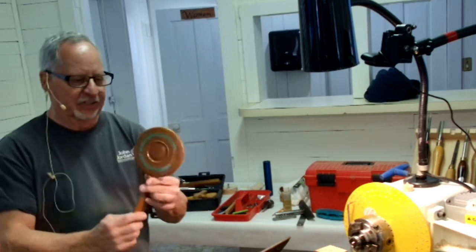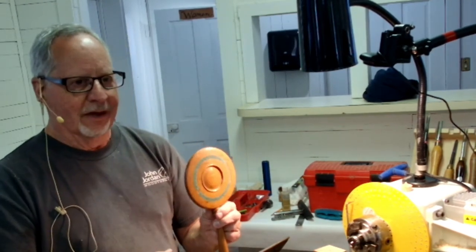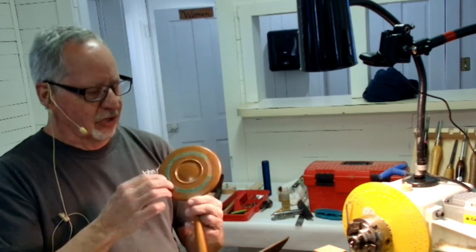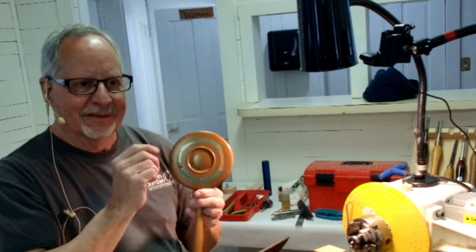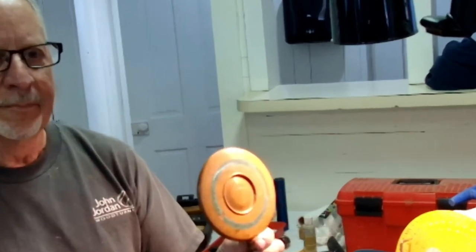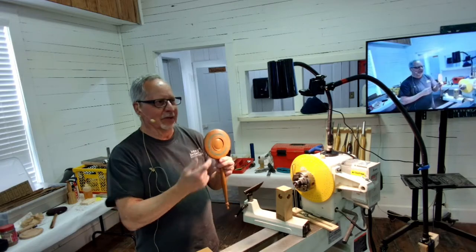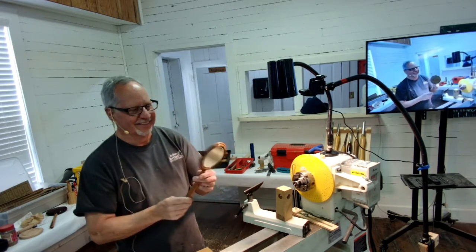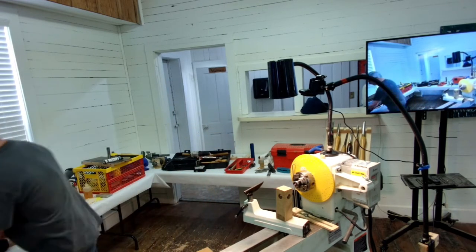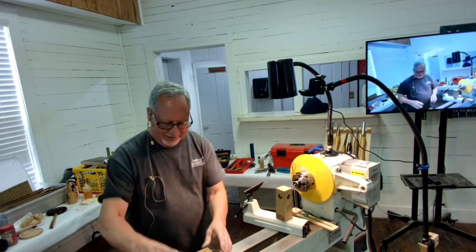Another tip: I used to do a lot of inlays with epoxy. You always get little tiny bubbles, and so I'm trying to turn those away. Don't turn them too far. You don't realize that your inlay really wasn't that deep until you find out the hard way. I've made about every mistake you can make on hand mirrors.